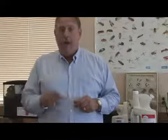We can put that inside the wall of the barn and it will actually spread all the way around the structure, killing the drywood termites as well. Another method would be to go up in the rafters — if we find termites are up in the rafters, we can treat the individual rafters themselves with the Termidor solution. It's a very good product and will help get rid of those termites for over five to ten years. Pole barns can be safe and you won't have to worry about any structural problems after that.